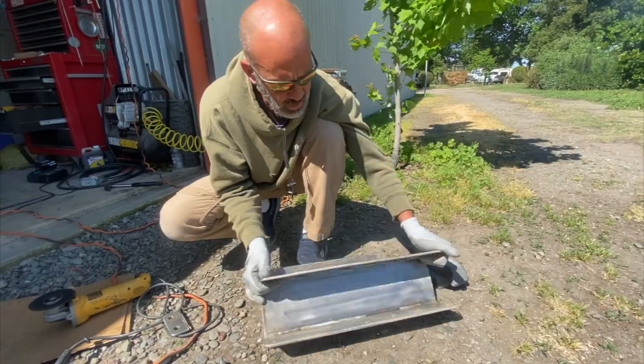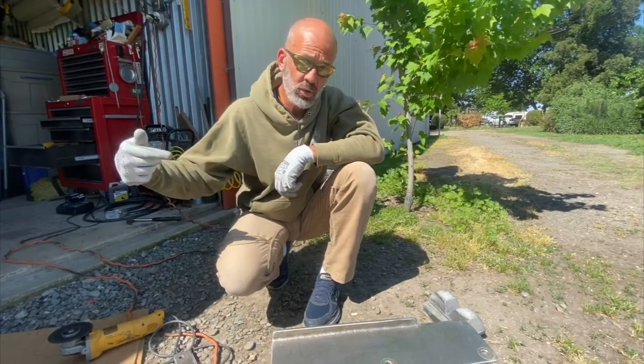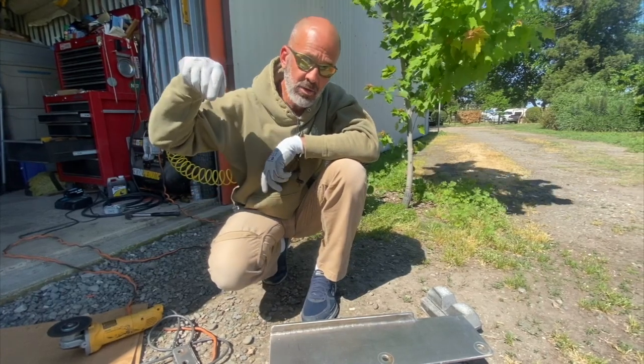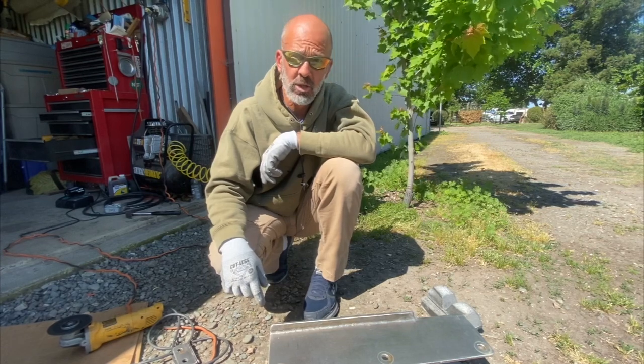The way I had this set up when I built the bowsprit, I drilled and epoxied stainless steel tubing in for cross bolts to go through, so we don't have any direct vertical penetrations into the bowsprit that would cause the new sprit to rot.